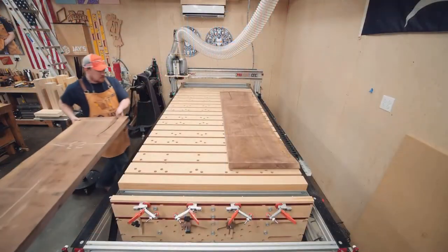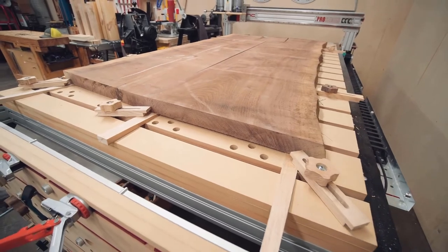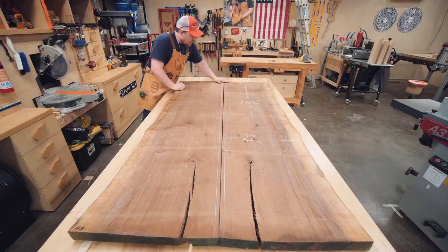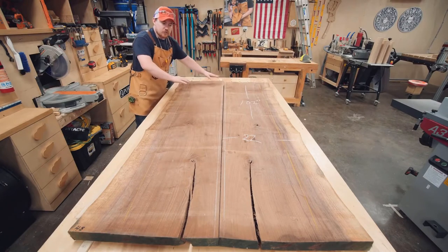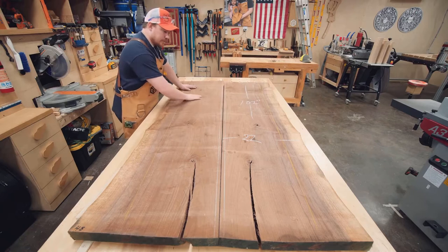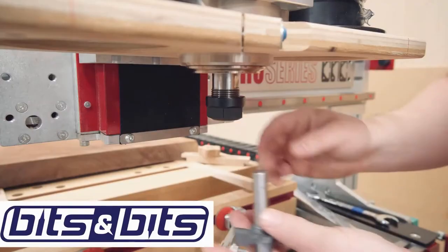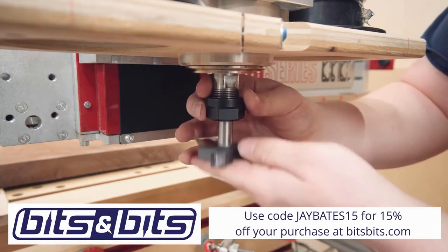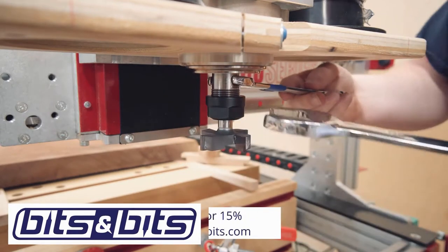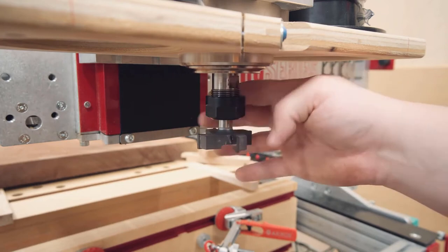What we're going to do is take these over to the CNC machine to flatten them, but we're going to put a shim on the opposite corners where it's sitting high and it'll split the difference. Instead of this being a half inch up, it'll go down to a quarter inch up on each side, distributing how much we have to remove from both sides. We're actually going to flip these over and do that same process on the bottom side - each one roughly flattened. We just need enough flat reference surface to also use the CNC to make a nice perpendicular seam cut on both boards.